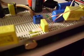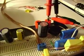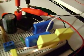This is a .033 across that coil as it's being pulsed — so it gives it a little resonance on that coil. And this is a 1 microfarad. And these are 2,200 microfarad — there's another one there, so that's 6,600. And then another 1,000 and another 1,000, all in parallel off of this bridge rectifier. But like I said, these capacitors here are 4.7 microfarad.